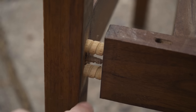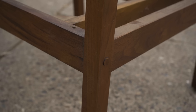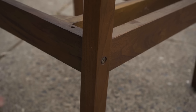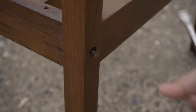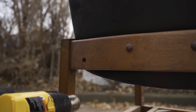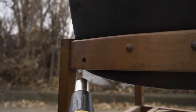Here you can see the screw and the dowels. On this one, I was able to get the plug out just by giving the joint a few taps with the mallet, and since it was so loose, that caused the screw inside to push against the plug and pop it out. Some of the joints were loose but not loose enough to come apart easily, so I had to use a heat gun to soften up the glue a little bit so I could get it apart.